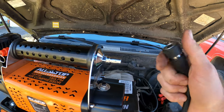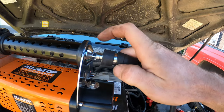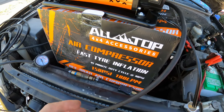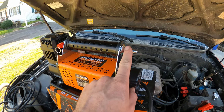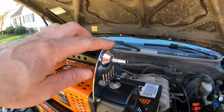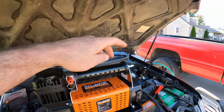The air connection style is not a very common one from my experience — I don't know if this is a metric style, but I don't have one of these in the States. I was originally going to swap it over to the style I use all the time, but pulling these threads out they're like a metric pipe thread — completely different than the standard NPT threads. So unless you get an adapter or drill new threads in the head, you're stuck with this.